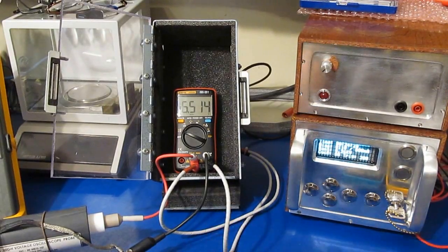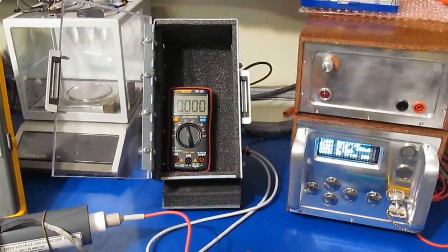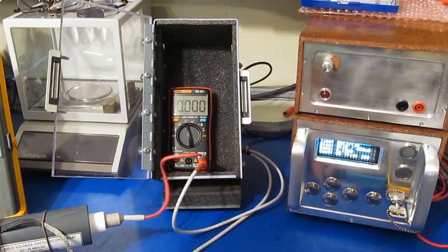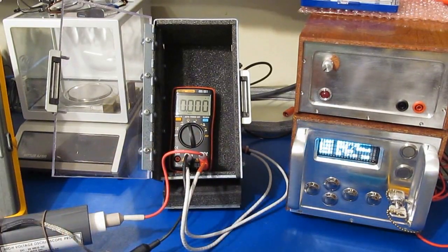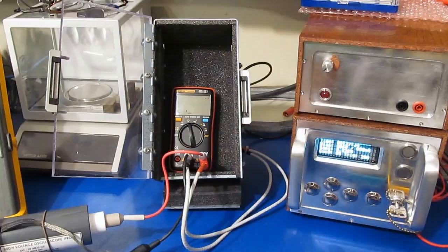Okay, that's it. Alright, so the meter survived that test just fine. Next we'll be running 2.5 kV. Again, this will be a 50 microsecond full width half height with a 2 ohm source impedance. 5 transients, positive and negative, each mode of the meter.